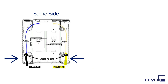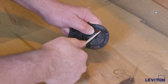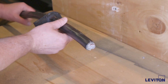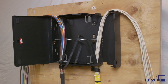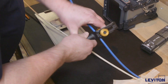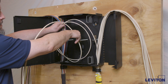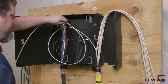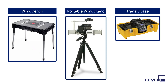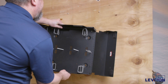Trunks can both enter the enclosure from the same side or from opposite sides. First, cut and install each entrance grommet onto each of the incoming trunk or group of trunks. The grommets can then be easily slid into place once the trunks are permanently secured to the enclosure. Due to the organizational requirements of so many fibers, Leviton recommends planning for one but no more than two slack loops in the enclosure prior to entering each splice tray. One slack loop typically allows for accessibility to a workbench, portable workstand, or transit case for fusion splicing. If space and cable length allows, removing the wall enclosure and placing it on a workbench is also an option.